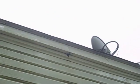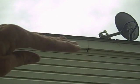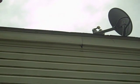And I'll send you a letter explaining what's going on, so it can be verified. Water's coming under your shingles because of a manufacturer defect. They ran the piece of trim too high, which created a little concave area on the roof, and all the water's going into that concave down the wall.